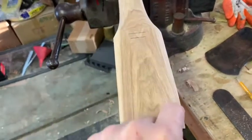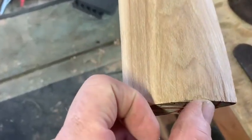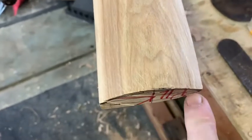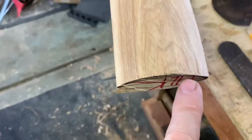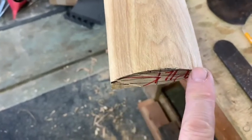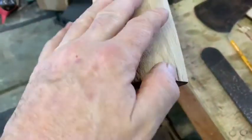Now, pulling it this way gives me extreme tear out, and you can see where some of this is left from the tear out, like right here and stuff. Now, I'm so close to my line here that that's making me really uncomfortable. There's ways that you can move your blade and whatnot. The biggest thing I have learned with the draw knife is when to put it down.